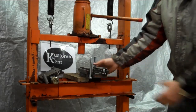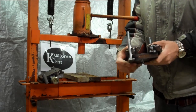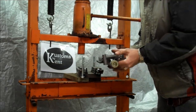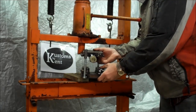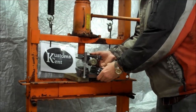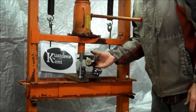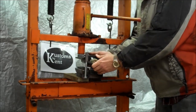It's just some layers of steel that I welded together — I experimented a bit to get to this. Here's a piece of inch and a half steel shaft. We put the flat piece of sheet metal right here, put the top on like that, and then we're going to put it in the press and form that shape. The material is four inches wide, an eighth of an inch thick, and I'll cut about five inches long. We'll put that in right here and use the press to press it together.